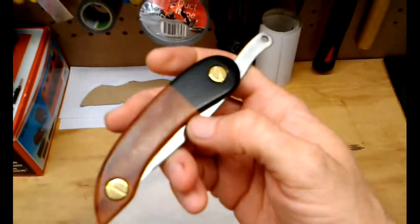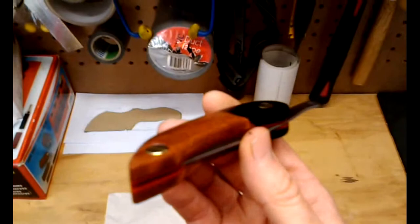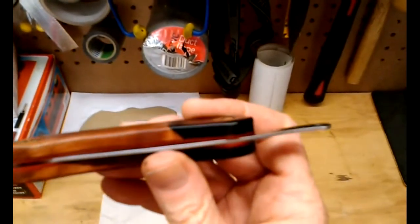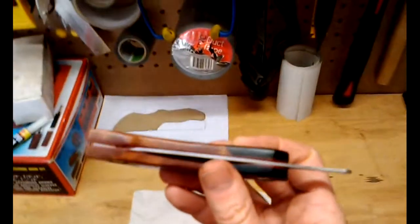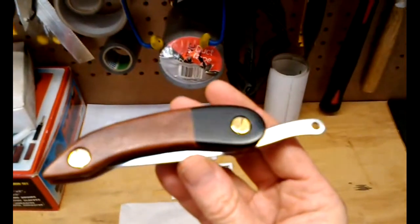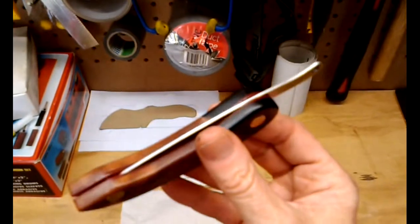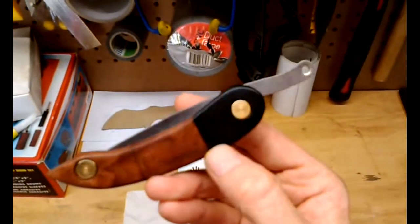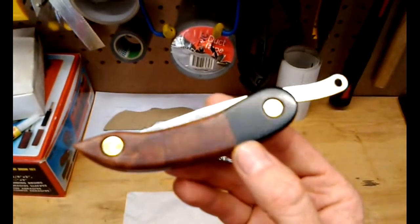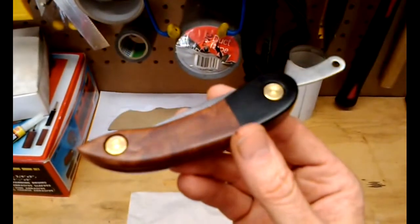And the other thing to tell you about was the countersinking, or setting the depth of the holes so the screws will sit flush in the handle. I used a carbide burr bit, a cylindrical carbide burr. Luckily for me, I've got a reasonable drill press where I can control the depth and speed, and change the speed to accommodate how fast it cuts, and yeah, it did a damn good job.